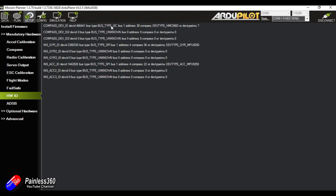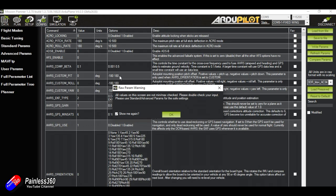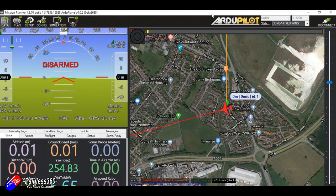In the hardware ID section of the mandatory setup list, you can see the purple cube doesn't have all of the auxiliary compasses, auxiliary IMUs and accelerometers that the full-size black and orange cubes have — that's one of the things we've lost using the low-profile cube. I also noticed the voltage wasn't being read in the main Mission Planner screen. It turned out I'd plugged the power module into the wrong bay — it needs to be in the power module one bay. Once plugged into the correct bay, everything burst into life and I could set up battery voltage alerts for the failsafe.